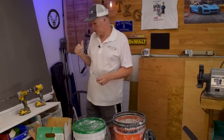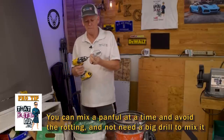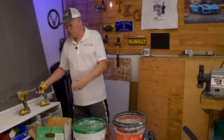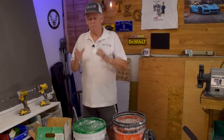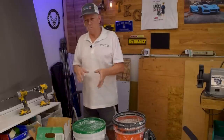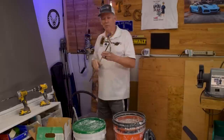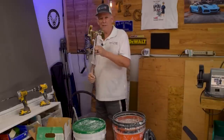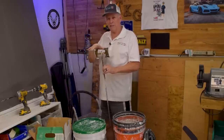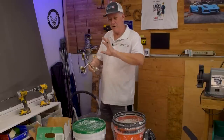If you're doing this part-time and just mixing up a little now and then and don't want to invest in a big drill, here's the cheapest way to mix mud at home: just chuck up a simple egg beater into your drill. Cost me 99 cents at the thrift store. Put some mud in your pan, mix it in there, and it'll be nice and creamy without having to stir up the whole bucket. If you don't want to buy this bigger mixer — which is around 40 or 50 dollars — this works great. The big mixer is nice because it doesn't shake the bucket like a two-bladed mixer, mixes faster, and blends things really well.